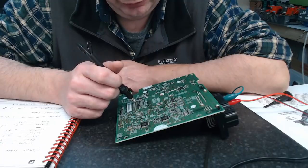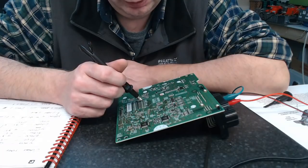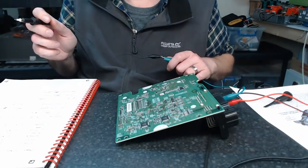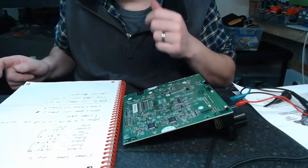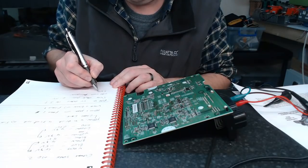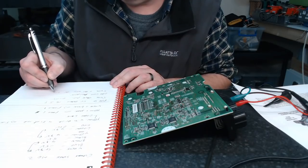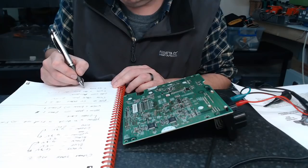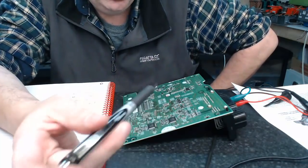But these are definitely the booster, there's no doubt about it. PWM duty, and the frequency is entirely different. So, there you have it, guys. Not bad for a bit of basic reverse engineering today. So we have 5 kHz at 50% duty, and let's call it 1 to 12. We have 7.45 kHz on 13 and 14. So that's how this thing works.